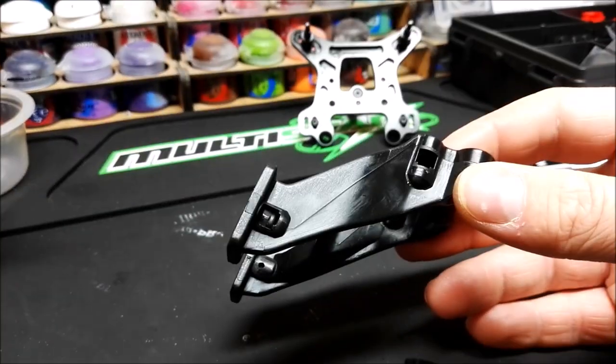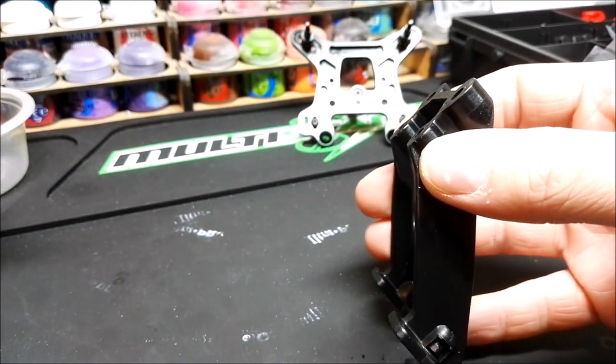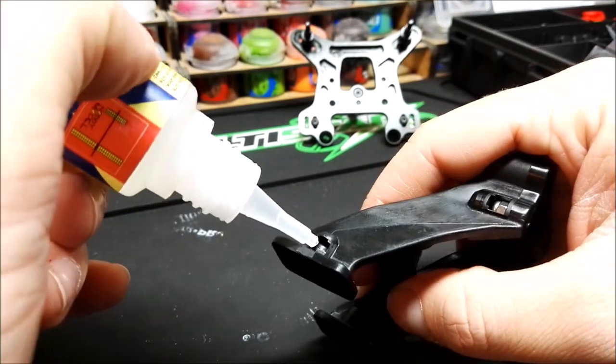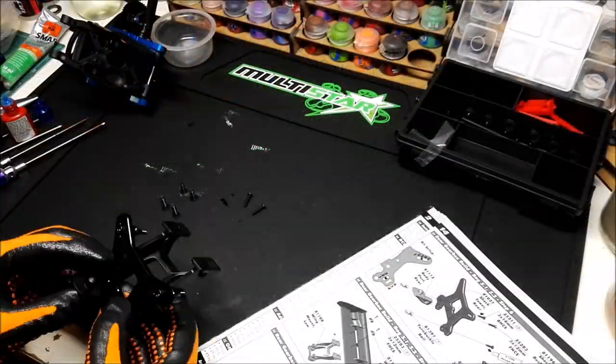In some plastic parts in this model you can find the socket in which you should put the nut. After placing it, positioning it correctly, I highly recommend pouring it with the cyanoacrylate glue, super glue, so it doesn't twist in the future when you would like to unscrew the screw from the model.